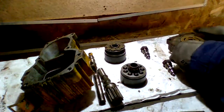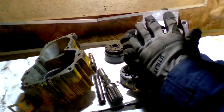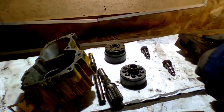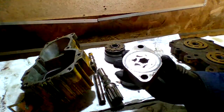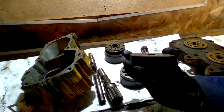You need another smaller separate pump to pull fluid up to it so that it can work. And if this were a later, what's called a ported hydro pump, this would also run a hydraulic lift, and there would be a couple of ports up here in these two spots. But this is too old for that, so it does not have them. The charge pump is only supposed to be mounted in one way, otherwise it will not work with the counterclockwise rotation that it receives from the engine.